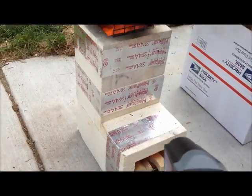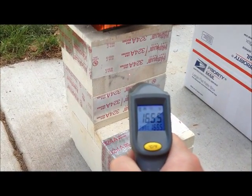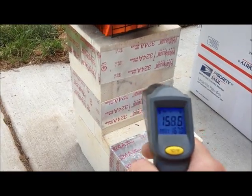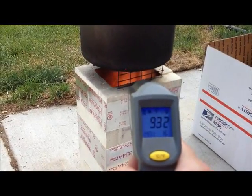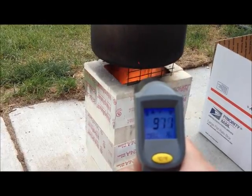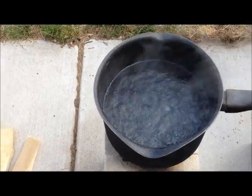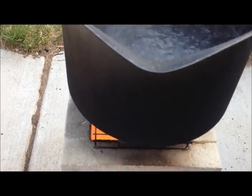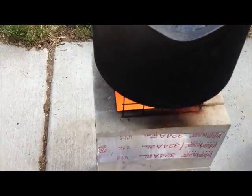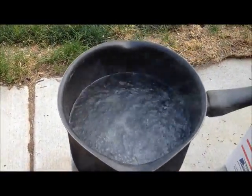The sidewalk is at 70 degrees. Side of the flue is at 138, 140. I've used my four original sticks and just added another one here. You can see the flames are still just shooting out, so back out the wood a little bit to adjust your flame.